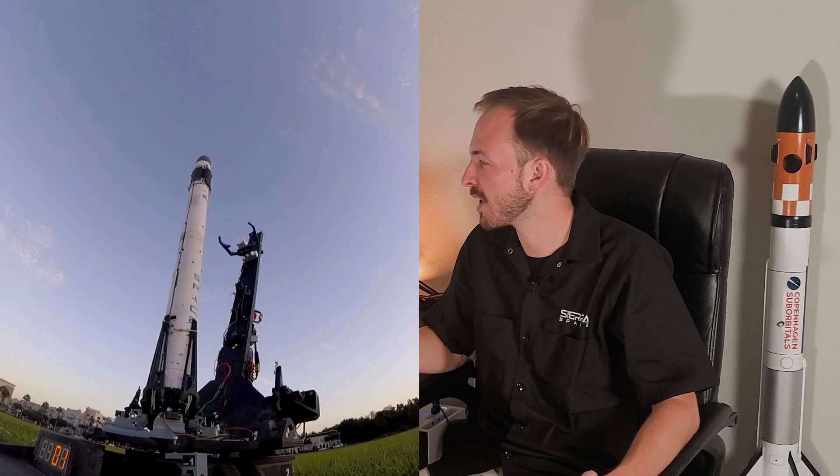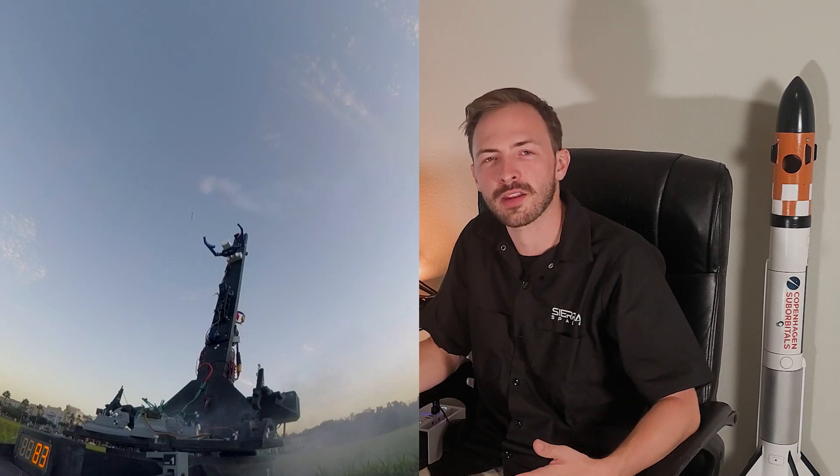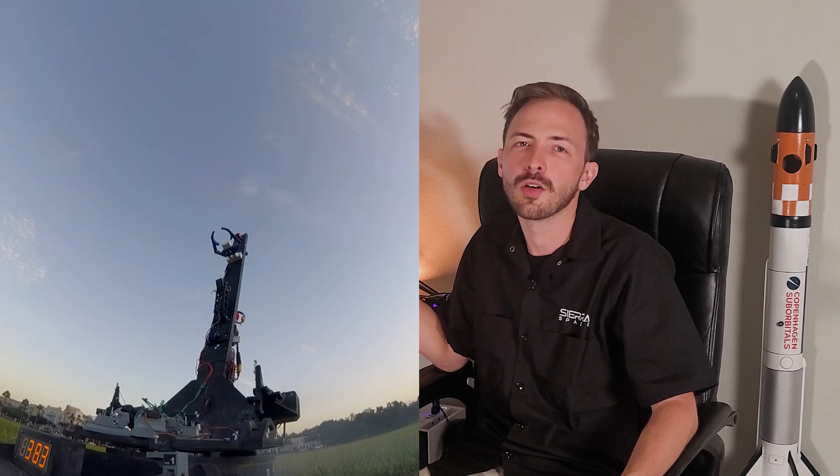The propeller testing and everything is a little bit underpowered compared to the motor I flew it on, so the tune of the rocket was a little below what we would have wanted to see, and hence we had some oscillations on takeoff. But overall it ran through all of its flight procedures and deployed its legs right before hitting the ground. I'm able to see when the different events happened on the flight and compare that with the altitude to see where our deployments happen, and how much time we actually have between triggering those legs, hitting the ground, opening the fins, and when they actually intended to open — because there is a lag time between whenever we want to trigger something and that's just built into the real world.